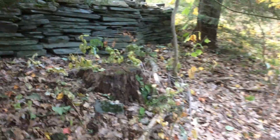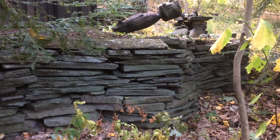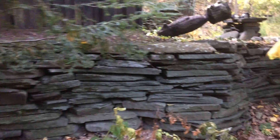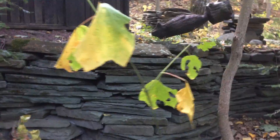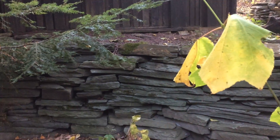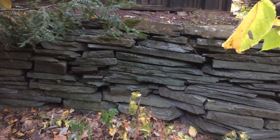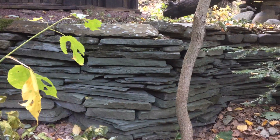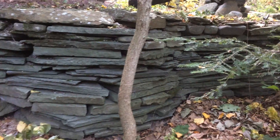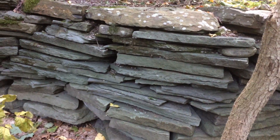On the downside you can see I had to go quite high — over three feet, really more like four feet high on this side. So these stones have to be massive; they need to be able to withstand sliding and be very stable, because if they aren't stable then nothing in your project is going to be stable. I was fortunate at the time — they were taking out a lot of bluestone sidewalks and I was able to get a bunch. They were broken up in many cases, which was actually good because otherwise I couldn't have moved it all.